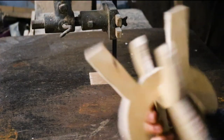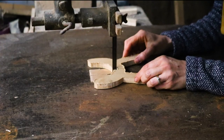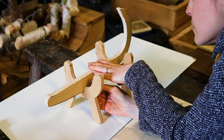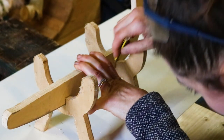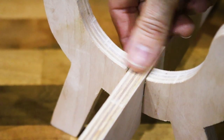Now I'm cutting notches out here so I can tie them together. The notch is the same thickness as the wood itself. But I'm going to give you a warning here: sand all of your pieces first before even measuring and cutting these notches. So I've got it on top as a visual, now I need to mark out where I'm going to cut the notch out of the longer piece, and it needs to be slotted down enough so nothing protrudes.